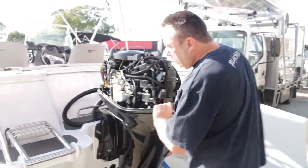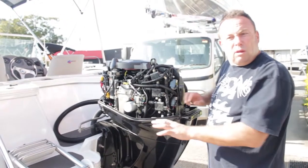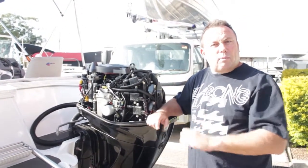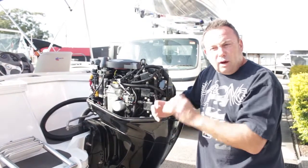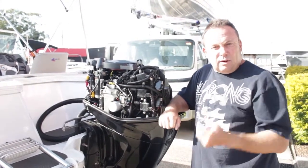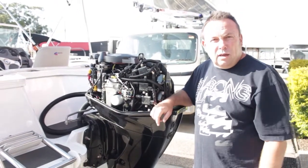I always like to check that the steering's okay as well. It's quite common if you don't lubricate with some oil that the steering locks up while it's been sitting in the garage. All the salt water sticks to the steering, goes inside, and jams it. You could go all the way to the boat ramp to find that it's seized. So if you do all these checks, you'll be good to go.